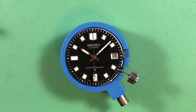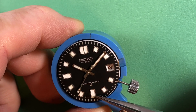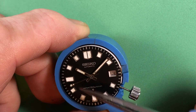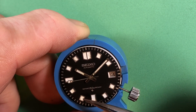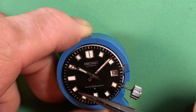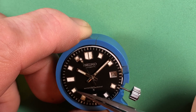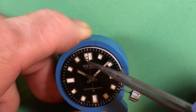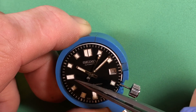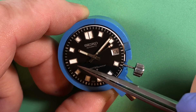Hands are in place, she is running. Your dial cleaned up — I remember this was like black. In order to really dig in there comes a point where there's only so much you can do. I got rid of the black flecks that were on top of the edges. Thankfully it didn't really corrode through any of those points — the worst it did was strip off some of the frosted finish, which is basically a little matte enamel. So I went around and repaired that.